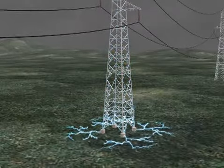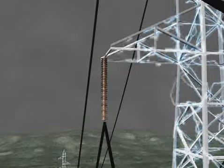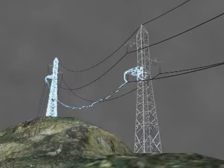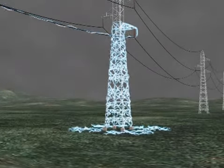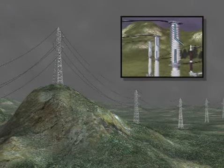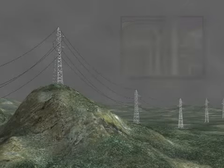When the power line passes through areas with high earth resistance, the protective capabilities of the overhead shield wires are reduced. In this situation, the risk of back flashovers across line insulators is significant. Any strike across a line insulator registers as an earth failure. The current is switched off at the station and then reconnected. A power outage has occurred.